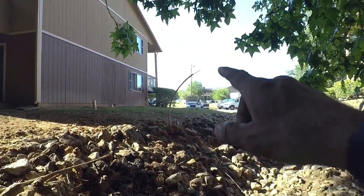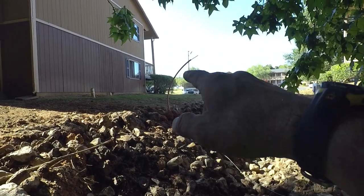We will be back here, and we got our temporary line - or the cable guys got their temporary line - and we got the conduit in here. We had called 811 but we were out here a little bit early. We didn't cut the line but we bumped the line and that was enough to pull it out of the splice. So anytime you hit a cable like that, when the cable guys come out to fix it, make sure you help out. I was here asking them what they needed, if I could do anything. The supervisor said you've been out here helping us, so I'm not going to worry about this - you're going to dig this conduit in for us, it's going to save us a ton of work. No worries about that. So if you do hit a utility, stick around, try to be super helpful, don't be a jerk about it and usually they're pretty cool about it. Luckily he didn't charge us.